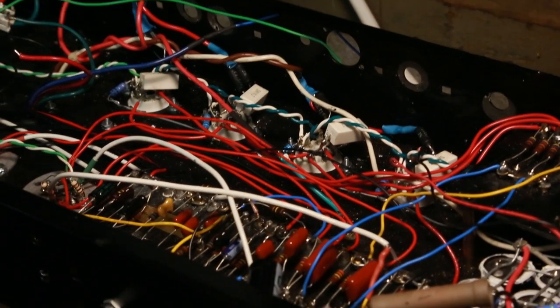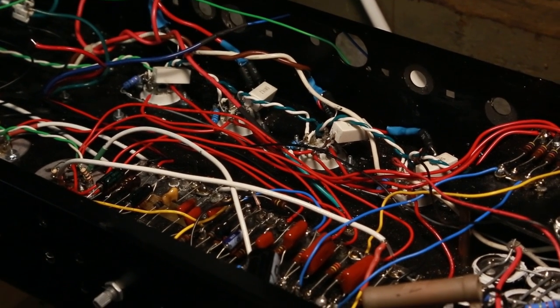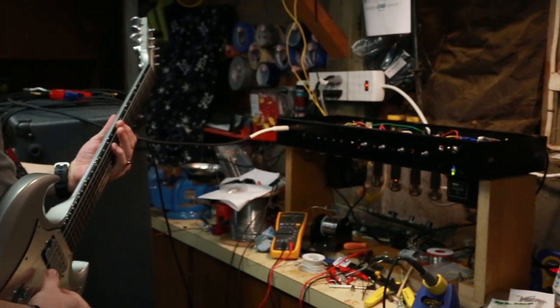We're going to go ahead and turn it on and see if the power comes up. And if that does, we'll try it out and see if that solves some of our problems with 100 watts in. Here we go. Okay, we got the LED light on. Tubes are all starting to warm up. I don't hear anything horrible happening. We've got the volume down to about zero. Now, as I mentioned in the previous video, it's possible that really the biggest problem was just that these tubes were getting kind of over their limit.